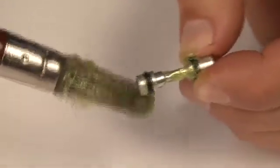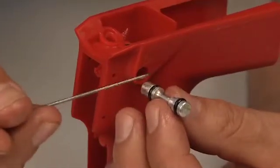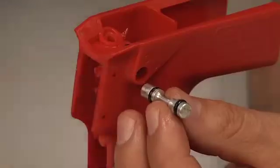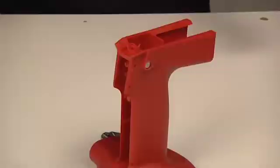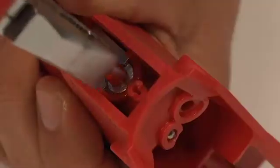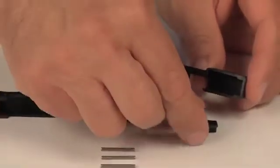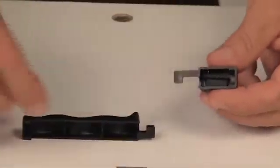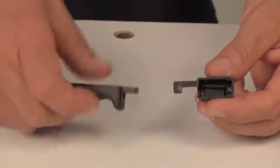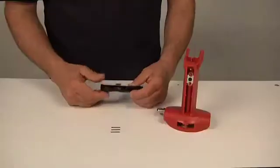Apply special grease too to the valve. Then, place it in its seat, paying attention to the insertion direction. Mount the pin, making sure it reaches the end stop. Remount the lever kit, inserting the locking device inside the tensile strength button. Then, join the suction control lever, and place the unit inside the handgrip.